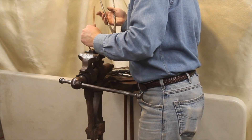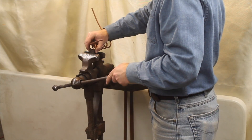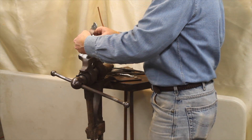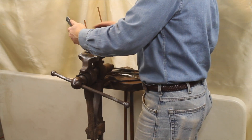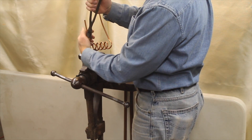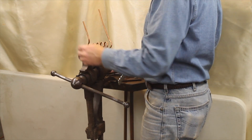We're ready to get the leads coming straight out. After the first bend they're actually canted out still a little bit by the angle of the coil. Having worked out the clamping details on the first round, the second round went a lot easier. It's angled outward a little bit so I'm going to bend it inward just a bit. Tongs are going to give me the purchase to do that smoothly. It's actually easy to overbend if you do it with just your hand — the extra leverage from the tongs means I'm not pushing as hard and I can control the sudden yield of the copper better.